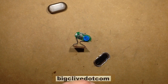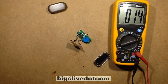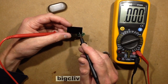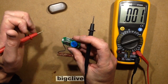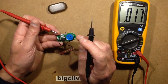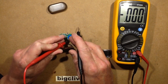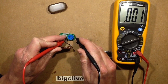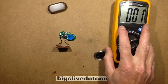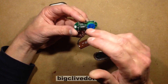Is that really a 1.2 volt cell? Keep in mind this is a four-section solar panel — it's probably putting out about 2 volts, which will be going through a diode to charge that cell. I wonder if this chip is actually a dedicated chip just to this task. Let's measure the voltage of that cell — it's probably going to be somewhere between 1.2 to 1.5. It's 1.28. That's reasonable enough. It is just a single cell. That's quite interesting. I wondered if they were just maybe using something like a standard timer chip — I'm going to have to go and look that up.